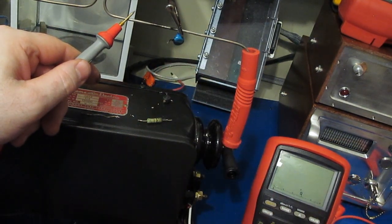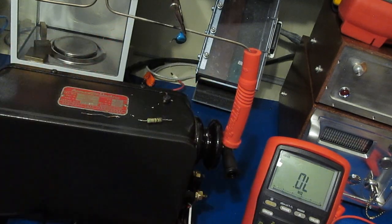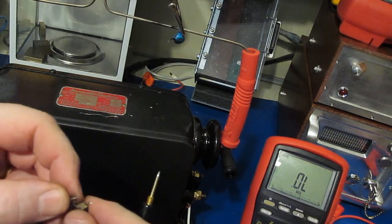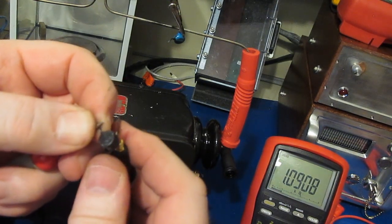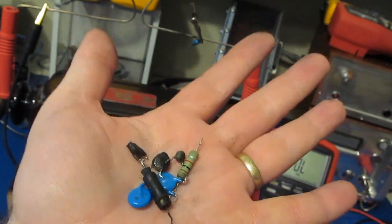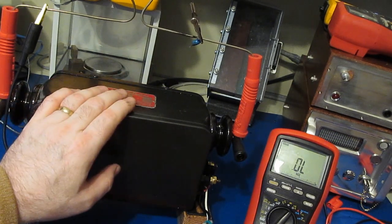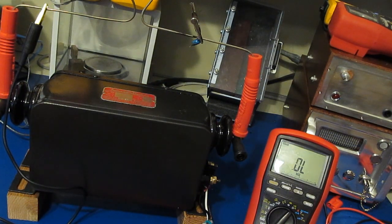Going to resistance mode — 130K. Checking the 1K ohm resistor: still about 900 ohms. The large PTC dropped a little bit, about 1.1K ohms. I don't think we learned anything new from this experiment. Certainly the MOVs can be damaged with high voltage, as can the resistor and the PTC, but at 30mA and 12,000 volts this isn't something anybody is normally going to be hooking their meter up to. Well, that's all for now — hope you enjoyed the video. See you later, bye!